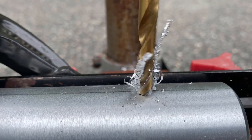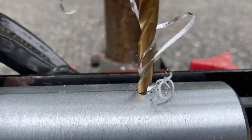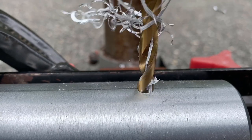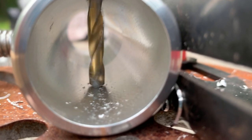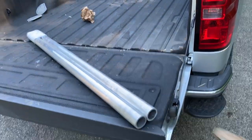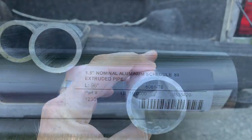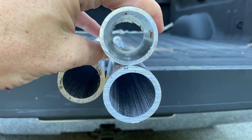All of the individual aluminum sections of the arch were packed up and brought to my home garage, where I could, as accurately as possible, drill out all the holes through the tubes and ultimately bolt the entire assembly together. I also built some very simple daviting arms out of schedule 80 aluminum tubing, which for its intended use is far stronger than the schedule 40 used throughout the rest of the arch — you can tell by the thickness of the tubing wall.